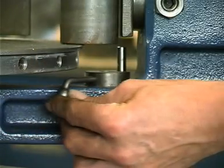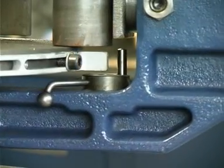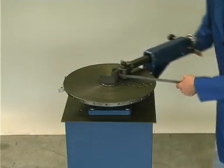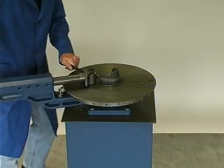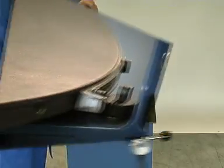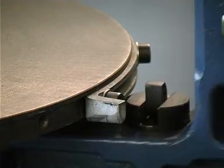The start and stop positions are selected manually when bending scrolls with more than one twist. If the automatic stop facility is used, this is switched automatically.